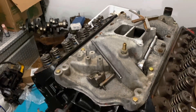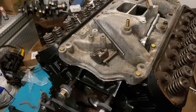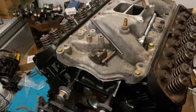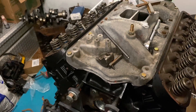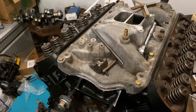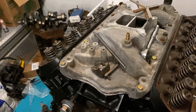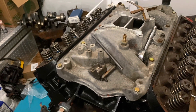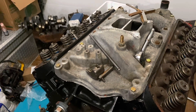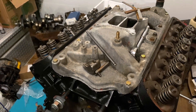Welcome to another video by Mox Marine. Today I'm working on a Ford 351 Windsor marine engine. This engine originally came with what's called a flat tappet camshaft, which is not roller. If you've watched enough of my videos, you know I don't like building engines with flat tappet cams — they put a lot of risk of wiping out a cam during break-in. I spoke to the customer and he agreed to upgrade it to a roller cam.